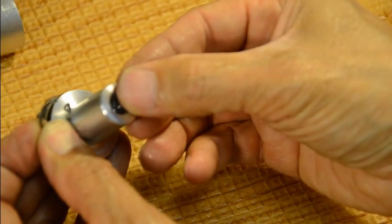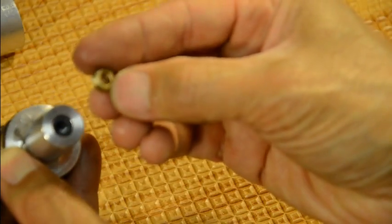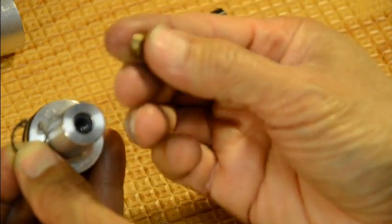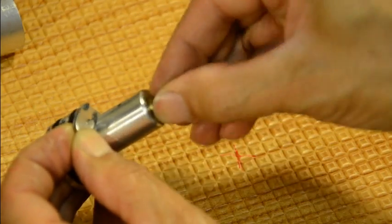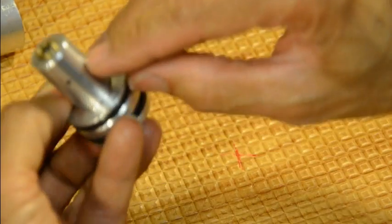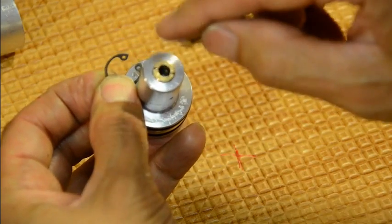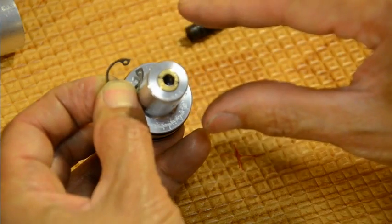Flip it over and remove the o-ring here, then your o-ring retainer. Screw it in — it goes all the way in, passing the portholes. When it bottoms out, you feel it squeezing the o-ring and that's as far as you go.